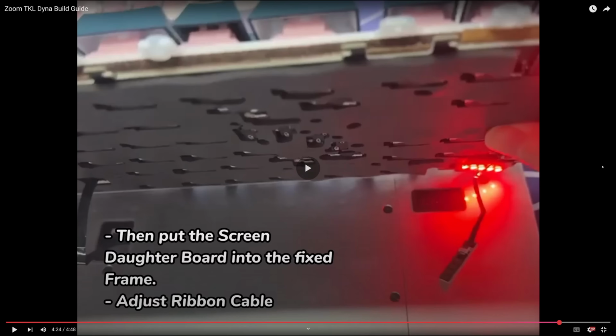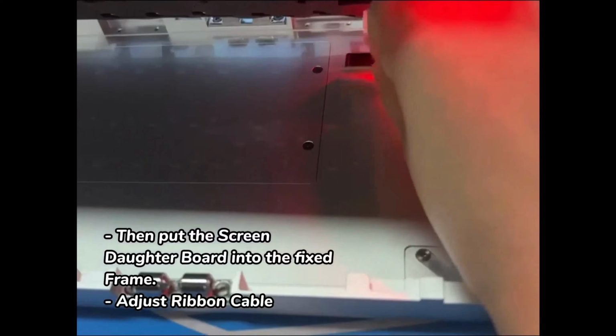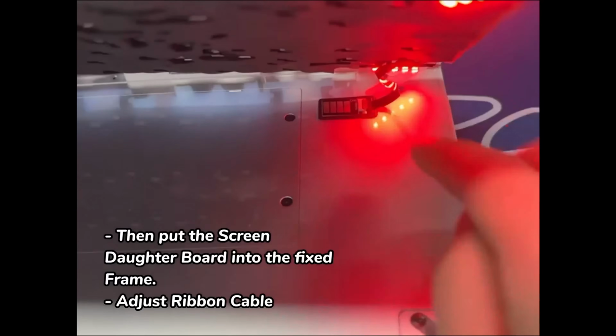That can break. The ribbon cable is connected to a little PCB that you just kind of stuff into the bottom case with a little bit of rubber piece to hold it in with friction, and that allows it to pop off without breaking. Whereas the main PCB is ribbon cable to ribbon cable. If you pull it off without remembering that, you can break it. So that's the main drawback of it.